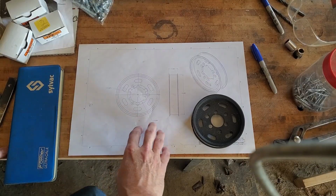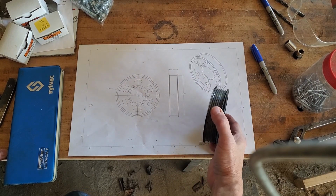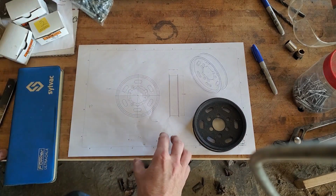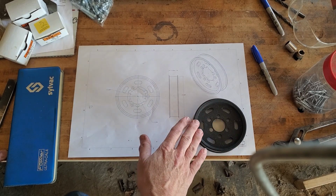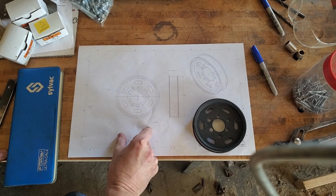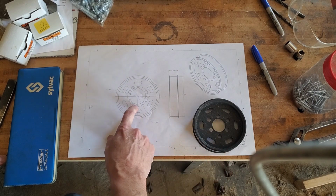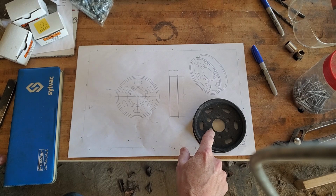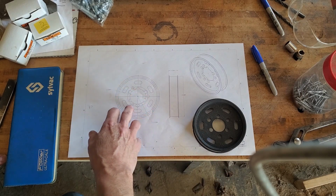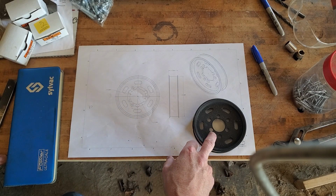So working on the front end drive of the Spitfire, this is going to be the pulley that drives the fan clutch. And he's got that mounting on a hub that contains a bearing. And then there's going to be another standoff. I think the bearing is part of a standoff that goes forward and holds the fan clutch and then clamps against something. So this ID has to be opened up to 1 11/16. It's going to break into really all of these holes. And then we have a new three-hole pattern on 2-inch 200 thousandths that I have to fit in between here.